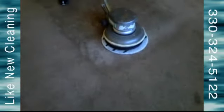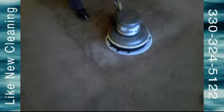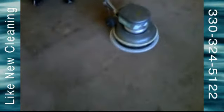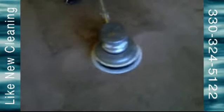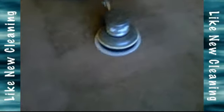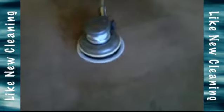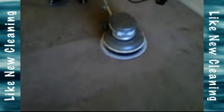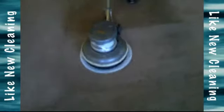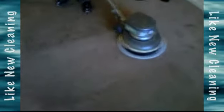So next step, we're going to run this bonnet over top of here. Bonnet cleaning, sometimes called the absorbent pad method. The reason why I like this particular method is — again, I have put a lot of detergent on that carpet, and as I said, we've oversprayed this just because of the condition the carpet is in. But you can pretty much see what's happening. All of that dirt, instead of running down into the backing of the carpet, it's getting adsorbed — it's actually getting stuck to the bonnet itself. Thus, it's not going back into the carpet. Now we're going to follow this up with some hot water extraction. You can see what's going on right there — that bonnet is just wiping all that soil.